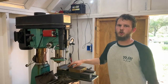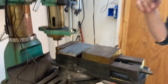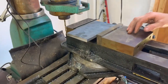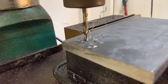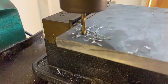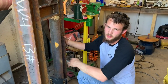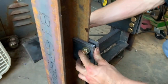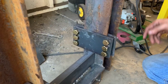Right now we're going to drill our holes in our side plates for our trolley. We have a bunch of holes to drill. We're starting with a small bit, then we're going to run up to a 5/8 hole, because we'll be running 5/8 bolts through the side of these. We're done with most of the drilling for our trolley setup. We've got these plates all drilled out and bolted up. The only thing we need is spacers in here, but that should be pretty simple.